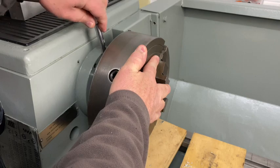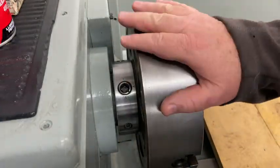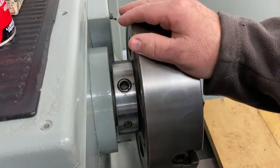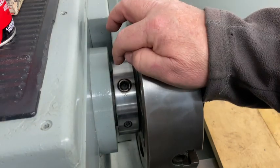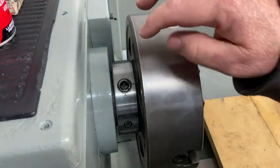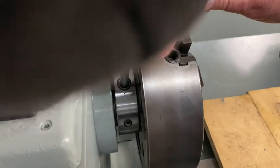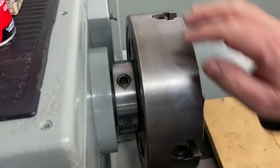While I'm tightening up this four-jaw chuck, I just want to touch base on this topic: always check your cam locks to make sure they're in the lock position. As a high school shop teacher I've stumbled across students who have changed the chuck and either forgotten to tighten it or deliberately left it loose for the next student. Occasionally it doesn't hurt to put your spinner on there and just make sure they're tight, but a quick visual will ascertain whether they're locked or undone.